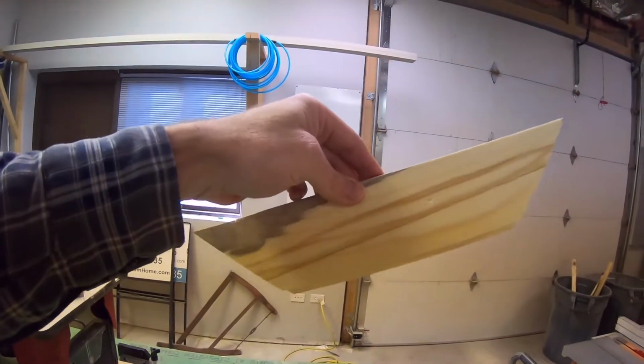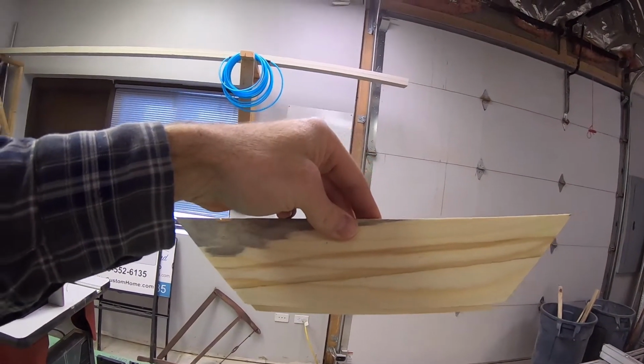But I've routed out that back end at 1/4 inch by 1/4 inch. So what you have to do is measure on your 4 pieces. You need to cut it a 1/2 inch shorter than the actual dimension, because 1/4 plus 1/4 is 1/2. So in this case, this piece is going to be my 8-inch piece. So I need to actually measure it at 7.5 inches, because I'm going to have 1/4 inch on this end and I'm going to have 1/4 inch on this end. Same thing goes with my 10-inch piece. Sorry, I'm going to have 1/4 inch at the top and 1/4 inch at the bottom on that dado reveal. So I've actually got them measured at 9.5 inches short point to short point. So I'll go ahead and cut these and I'll set it back up and I'll show you how that lays out and show you how those numbers add up together and make a little more sense.